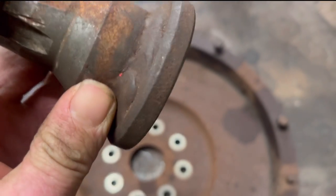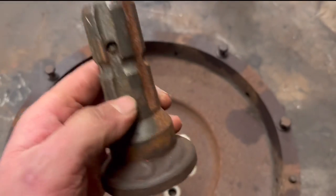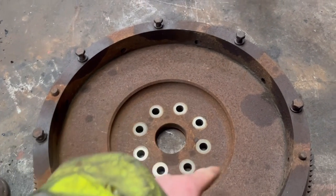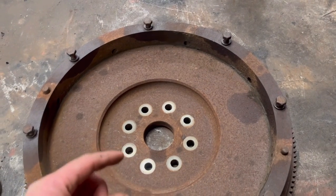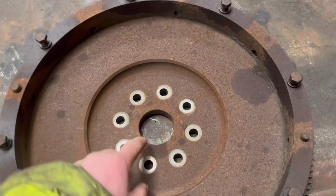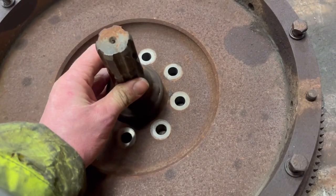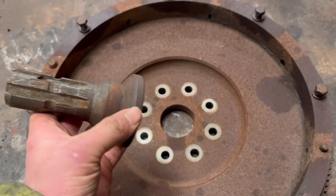So that's already had something welded to it. So it's not ideal, but that's what he supplied, and that's what he wants doing, so that's what I'm gonna do. So first job, I'm gonna flame cut a circle out, about 140mm in diameter, out of some 30mm plate, and it gives me enough thickness to go inside there, and it'll be a 10mm flange for the bolts. Then this will be spaced 10mm off, sunk into a hole, so it's lined up true.